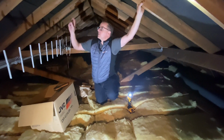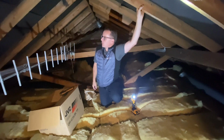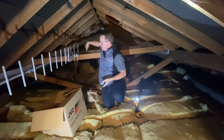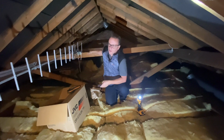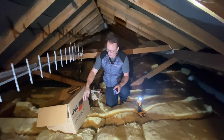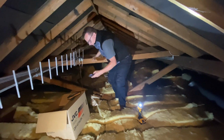rafters that are around 38 or inch and a half, 2 inches by 4 inches, the old size. They should span up to about 2.4 meters. If any of you have got the Pocket Surveying Buildings book by Malcolm Hollis, it's absolutely brilliant. It's got some basic span tables in there, which is invaluable to have, particularly early on in your career. So for students, that is a brilliant book to get.